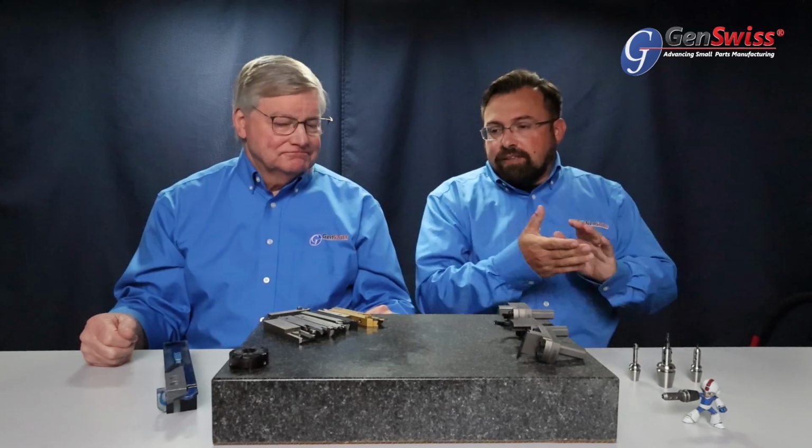We do a ton of that, especially with the medical industry, where you've got irregular threads that are not symmetrical and they require large amounts of material removal. Thread whirling is an expertise of ours. We're able to get you set up with that from start to finish, whether you need the live tooling, whether you need the ring, inserts. We're able to do all that. Very cool.